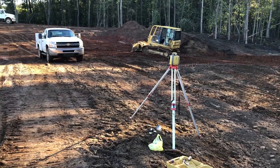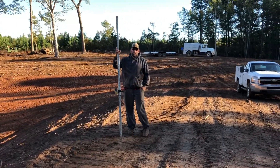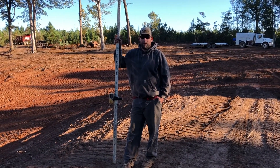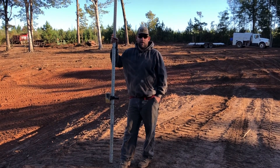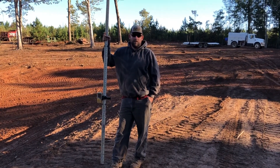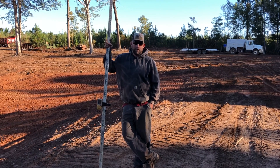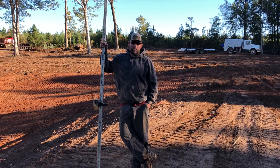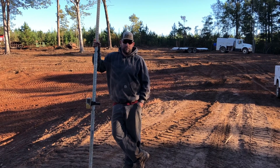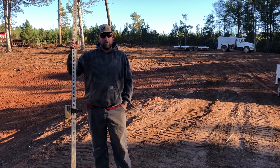We've got our transit set up and we're getting ready to start putting in our siphon system. Nathan's checking the grade. He's going to explain how you figure out where to put the siphon system. After we finish the dam, we check the elevation of the top of the dam from one side to the other, and we put our spillway at least two feet below the top so water never reaches the dam top. We always have the pipe three feet below the top of the dam, giving you a foot of water retention in the lake before it starts coming through the spillway. The spillway would only be used for a big flood or a really heavy rain over two or three days.